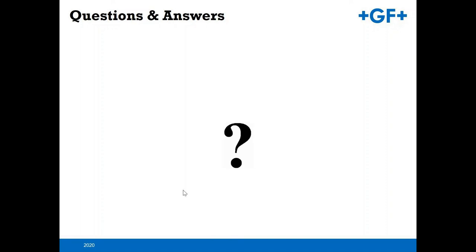The other option would be going to, as Jeff mentioned, a Modbus module. So you get a primary and secondary function out of those. You can collect the flow data in real time, and then also on that same stream, see the totalizer output. So again, you can pick up those two items off a Modbus module, which would be an optional addition. We also have on the 9950, don't have the free open collector, but we do have the relay options there. And we also offer a Modbus module that will transmit both channels along with the secondary outputs on that particular system. Okay.